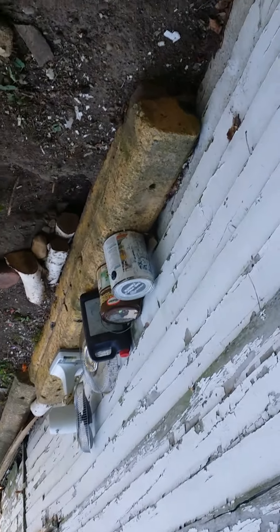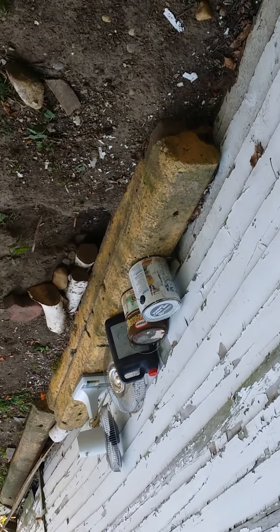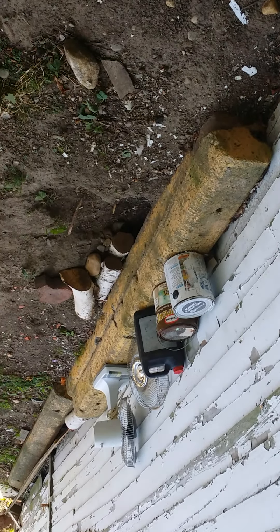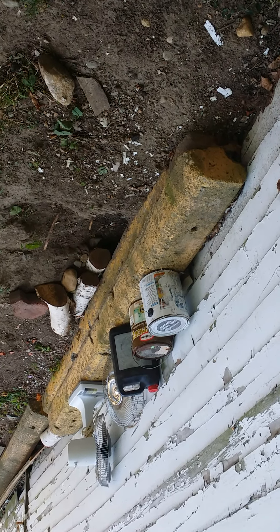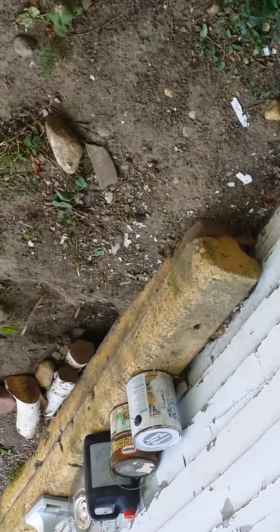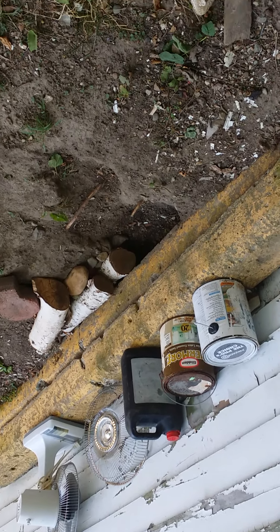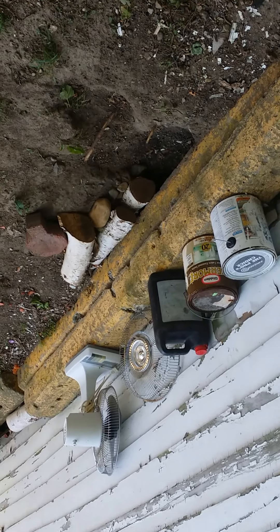Here's the backside — this will all get lifted up. These are some old parking concrete blocks; we'll pull those away and new footings will be put in. We're going to drop treated lumber down in there two feet deep and sandwich that with a piece of galvanized metal to keep woodchucks from digging back in. They tend to be just relentless when they get in there — though they've actually seemed to disappear this last week, I haven't seen any around.